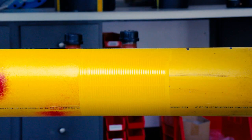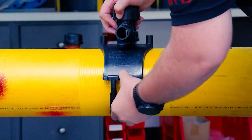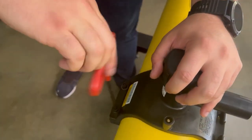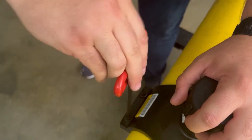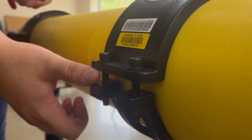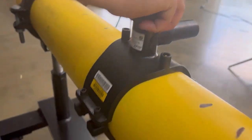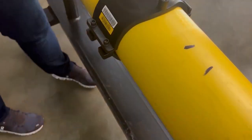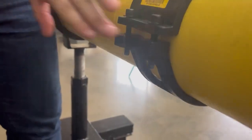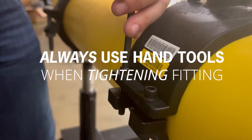Open the under clamp, place the tee on the main, then close the under clamp. Next, tighten the tee onto the pipe by turning the two screws clockwise. These screws should be evenly tightened but not bottomed out. The tap tee is sufficiently tight when it doesn't move around the pipe when pushed with reasonable force. These screws are not designed to be bottomed out — if bottomed out they will likely be over tight, which may lead to fusion failure. Always use hand tools for tightening, never electric or air tools.